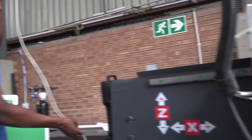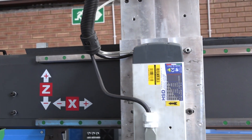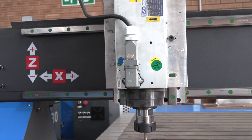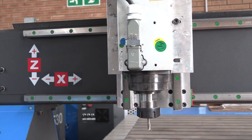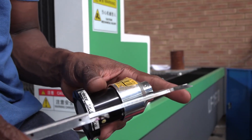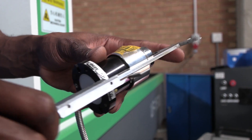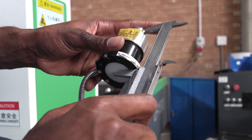The wiring is done and your machine is off right now. Once you're done, turn it on and it's going to ask you if you want to home it — yes, do that. Home it to the origin position, and the next thing you want to do is set the thickness of your calibration tool inside the system.